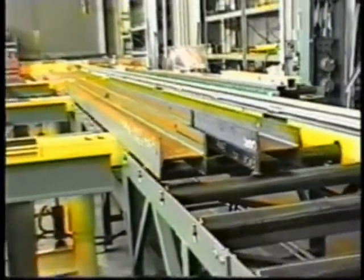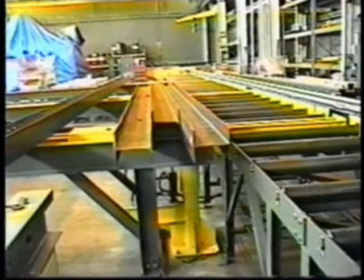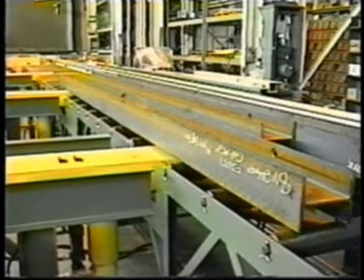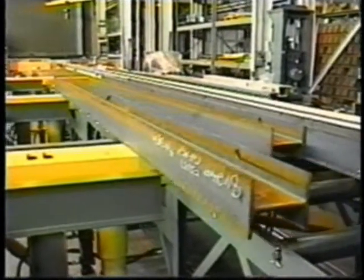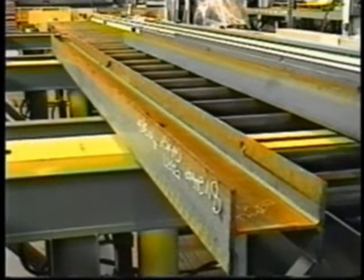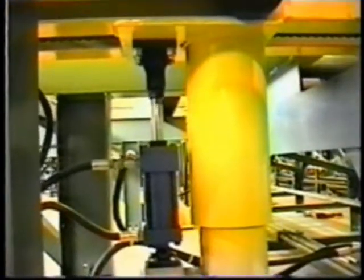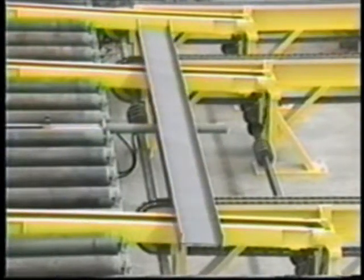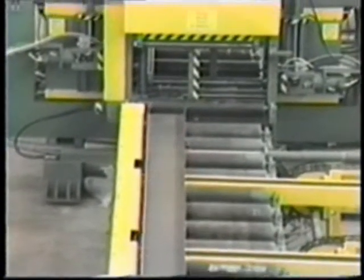Structural shapes up to 300 pounds per foot. The heavy-duty design of the BL Series Transfer provides hydraulic lift power for beams up to 80 feet in length and a cross-travel storage up to 25 feet. The Franklin HD 145 can be provided with several material handling packages from 300 pounds per foot to 750 pounds per foot.